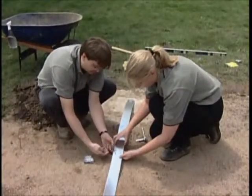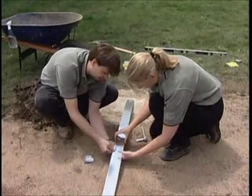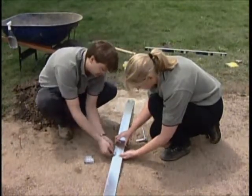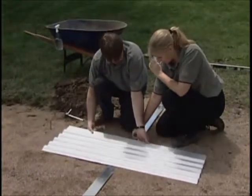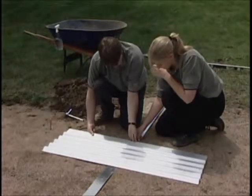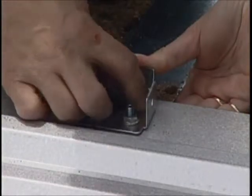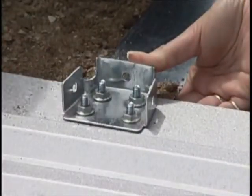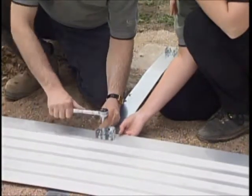Place 3/4 inch bolts through the 4 holes nearer the center of the pool, gently lifting the strap and inserting the bolts from the bottom. Place a hold-down plate over the bolt threads, making sure the wide part of the plate faces into the pool. Now place a buttress base plate over the bolts on top of the hold-down plates, with the open side of the base plate facing into the pool. Fasten tightly with 4 nuts.